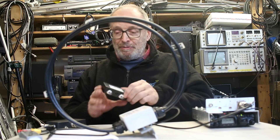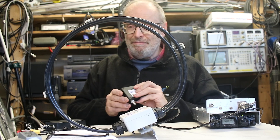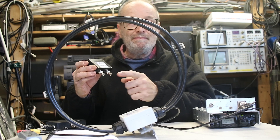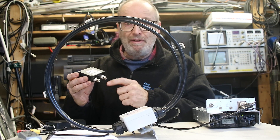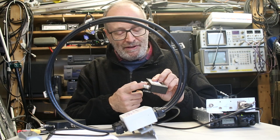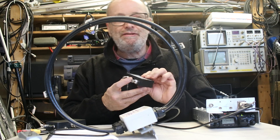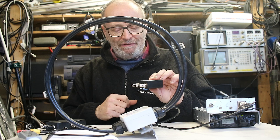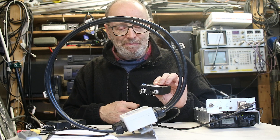The other options we have: there's the standard bias-T so that you can feed power to the antenna on one side. You feed 9 to 15 volts into the connector — one goes off to your receiver, the other goes off to the antenna to power it.